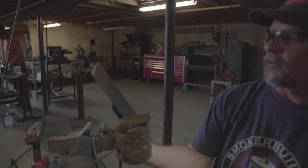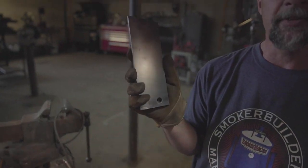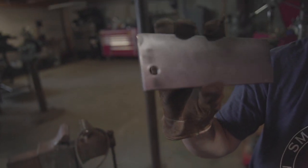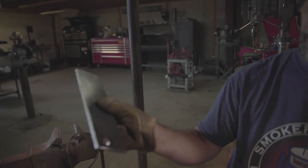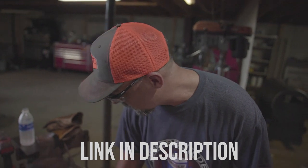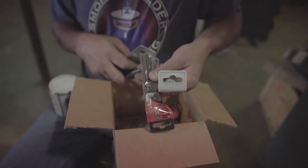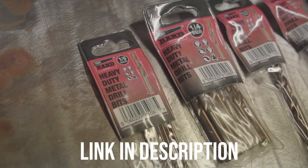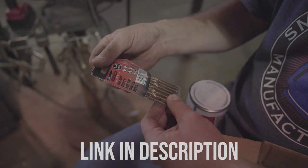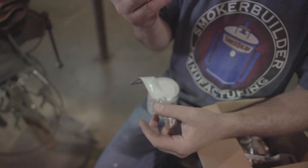Here's what we're going to do. We've got good old quarter-inch super hard HRPO plate. Pretty hard. This metal here is different than most metals — it's hard to drill holes. You can see somebody drilled a really top-notch, A-quality hole in that already. We're going to show you how to duplicate that process, both with a hand drill and this drill press right behind me. This company, TTP Hard Drill Bits, sent me this stuff. They saw the video I keep referencing with all the hatred. They sent me a whole bunch of sizes — from eighth inch all the way to half inch. They run a different angle on the cutting tip; it's like 135 degrees or something. We're going to give these a whirl.